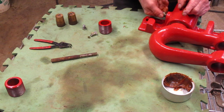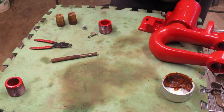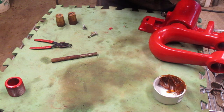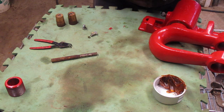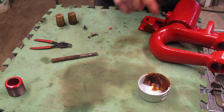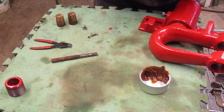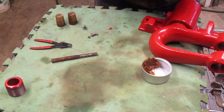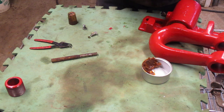It really doesn't matter how much paint you got in this thing because once you fire it up, all the sawdust is getting dumped there — it's going to get just annihilated. Now we'll put some grease on these threads real good because these are your saw guide adjustments — like the big handles on that other one I just showed you. These turn. These are half-inch square nuts in the back of these.